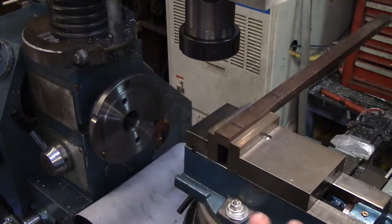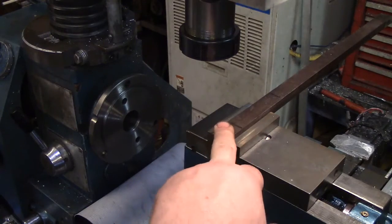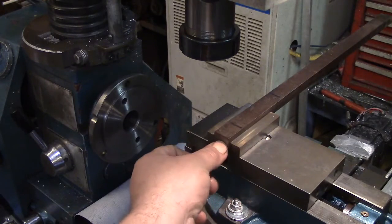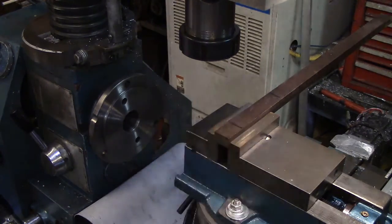Since I'm a high rake, low tool pressure setup here, especially with this one, this is going to be probably an aluminum bar only. I don't need a whole lot of meat down here to keep the bit from moving around or deforming. It's just basically to keep it there in front of the metal, so I've got a lot of leeway here.